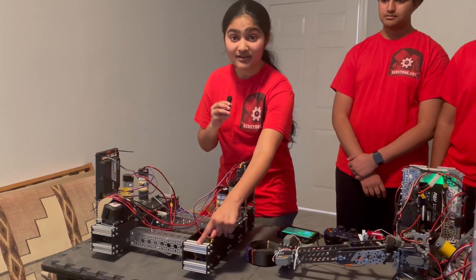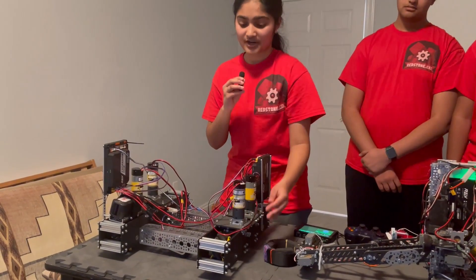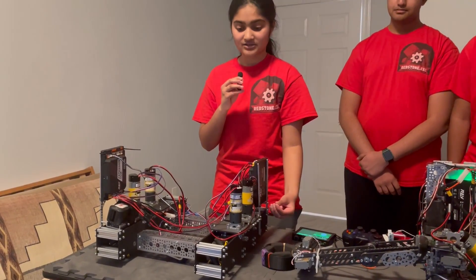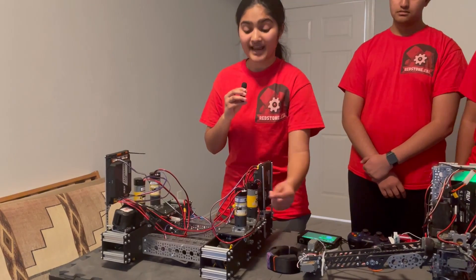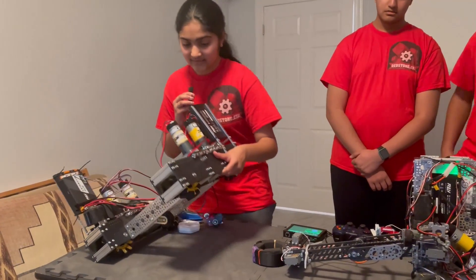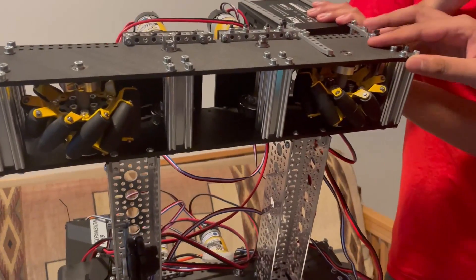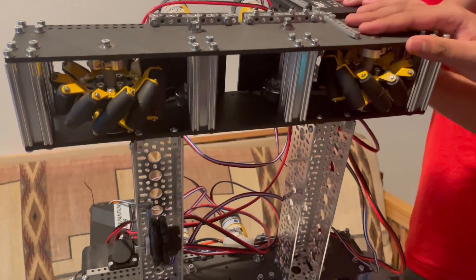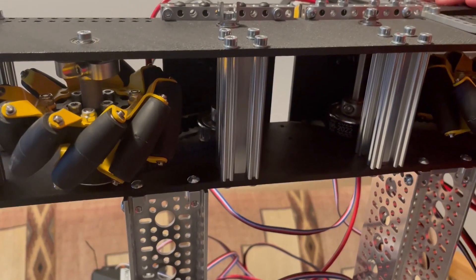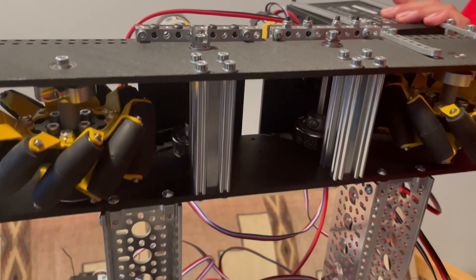We also have go rails keeping the plate together. These go rails serve to keep the drivetrain parts together, and they also provide protection so that if the driver bumps into parts of the robot while going fast, those parts will stay strong. The go rail is really light because it's hollow in the center. Underneath, you can see this is belt driven, and the belt drive assembly is tensioned really well. Our wheels also give us a lot more ground clearance — about an inch and a half — meaning we can run over pixels without getting stuck.